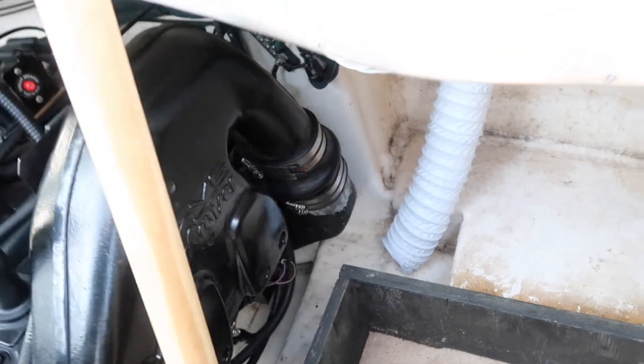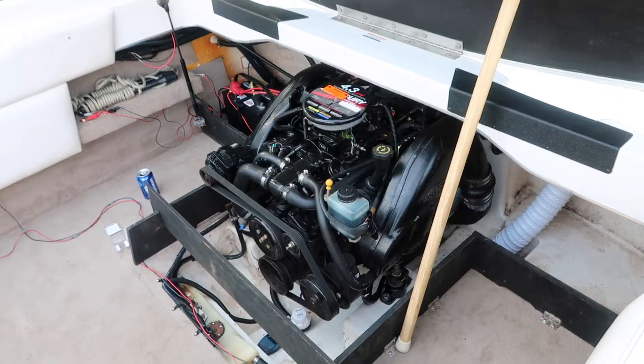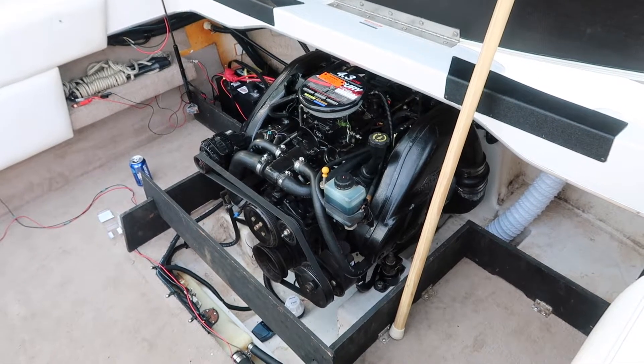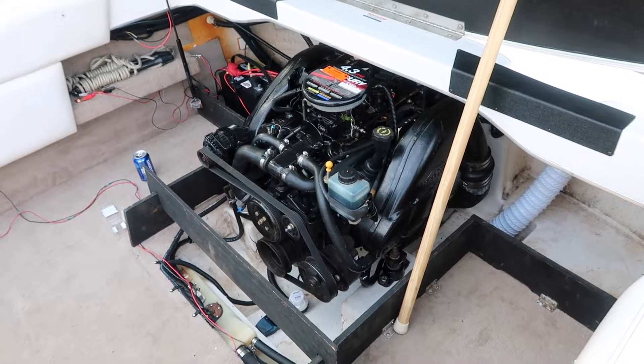You can turn your blower motor on, put your hand on the hose, and make sure it's sucking — that's extremely important. I wouldn't even run my boat without that. Sometimes through the channel you even want to have it on if you're going slow or just at idle.